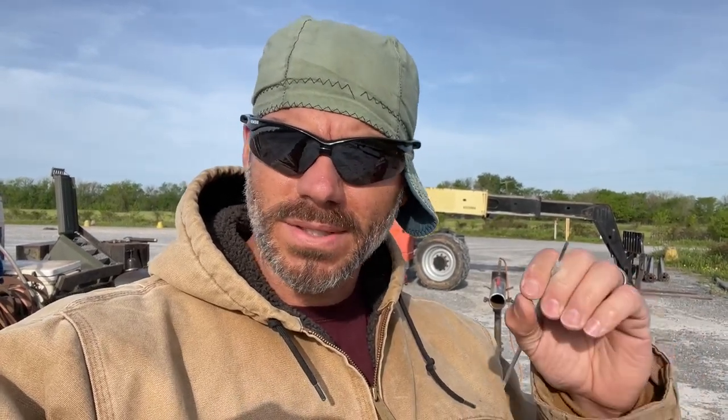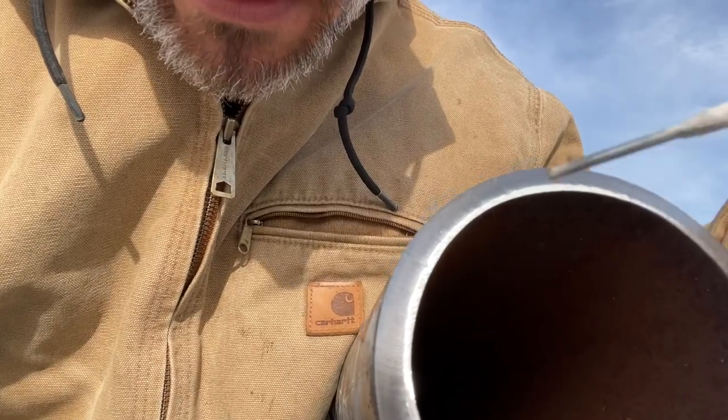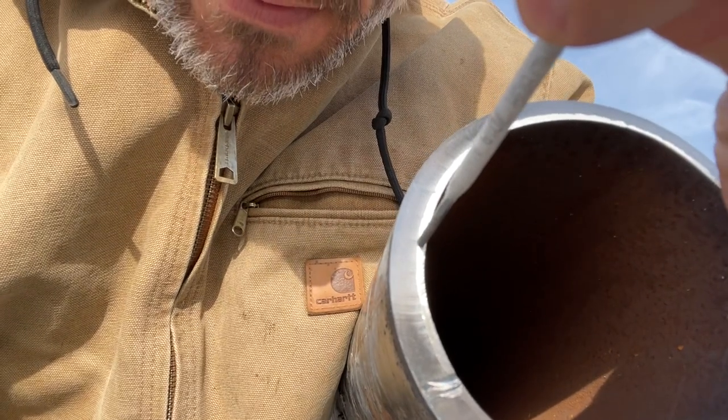That'll give you an idea about what I use — bevel a little bit sharper and just a little bit smaller land. We don't ever measure them, we just put something on. Nothing's ever perfect out here. Jose just got through putting a land on this pipe for me. You can see it's about a 3/32 — same as a 3/32 welding rod. It doesn't matter what you think, what matters is you can weld it. If you need a heavier land use a heavier land, but it all correlates together — gap and land — and there's a lot of imperfections that happen along the way.